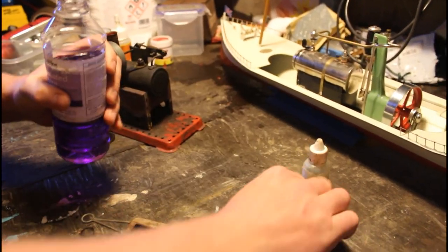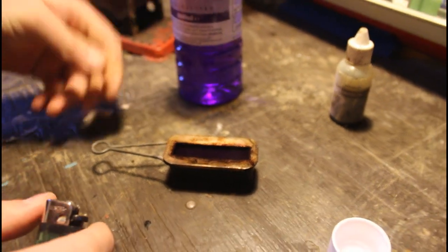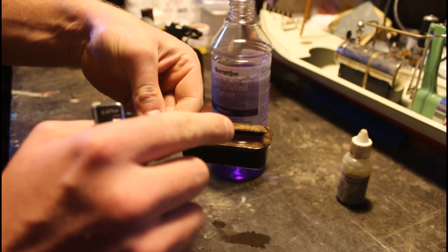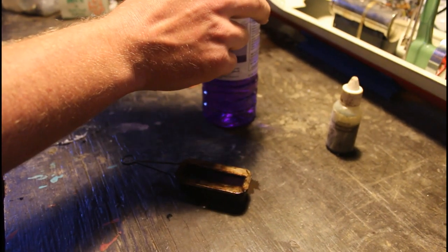The meths is very efficient at boiling the water and making a steam engine run. So I'm just going to pour it into the little tray here. It's got a nice deep bottom here, the reservoir to hold the liquid, and on the top there's a wire mesh which helps the liquid vaporize, because with meths it's the vapor that burns, not the liquid — much like petrol.